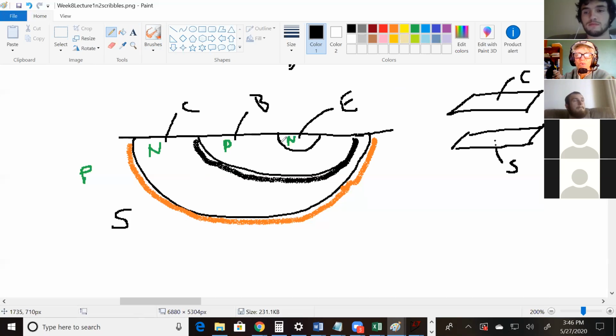What about this? In the forward active region, is this junction conducting or not conducting? That's conducting, yes. So you'd say, okay, that one's conducting, no depletion region, so there's no capacitance.